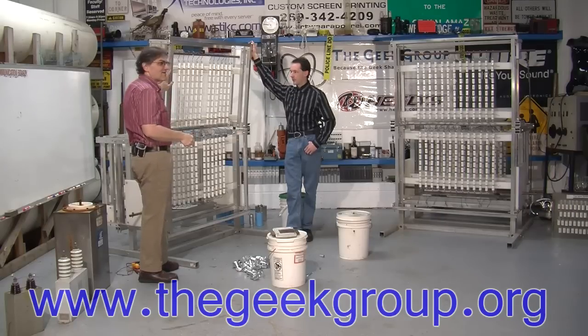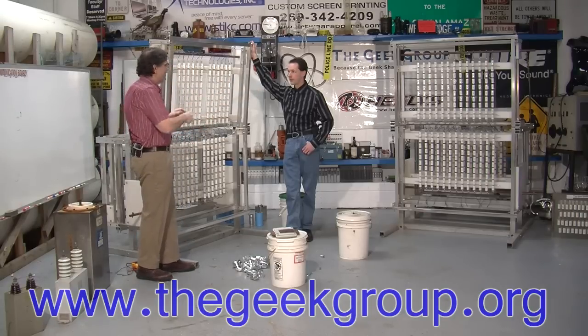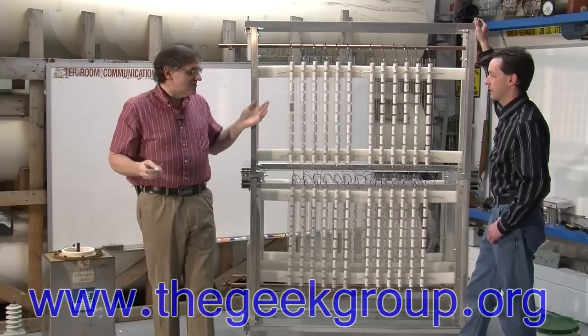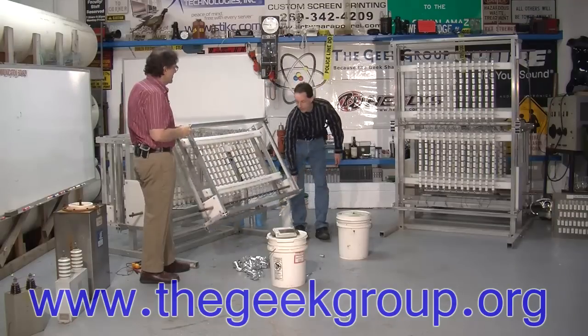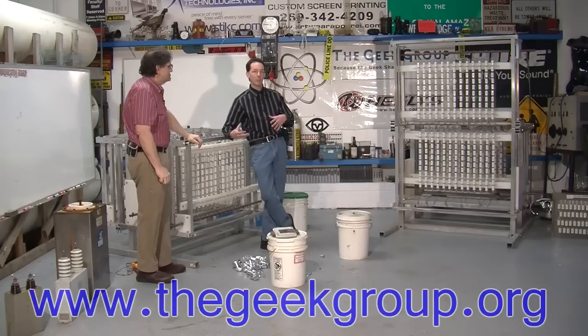This rack here has 25 strings in parallel, and our second rack has an additional 25 strings in parallel. So we tie both of these together, and we get 1,000 capacitors, 50 strings of 20. That makes it the largest by far. Most people that use MMCs have arrays of like 30, 40 caps. We needed something of large scale to be able to work on things like Zeus and Gemini and Arcturus and the big coils. And we wanted something that was infinitely variable.